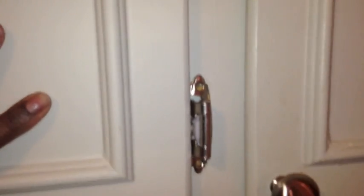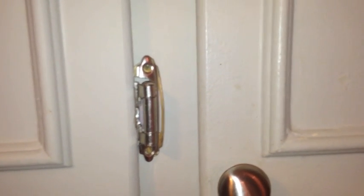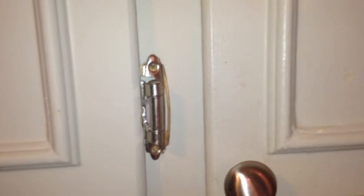Because you have that inner ridge in your cabinet, the hinge should just sit in place. You can see here my holes are lining up. I'm going to use that decorative screw and screw in at the bottom and then the top. But don't tighten all the way until you make sure everything is set — once you're sure all screws are fitting in their respective holes, then you can tighten them up.